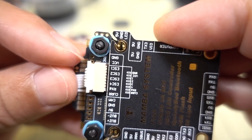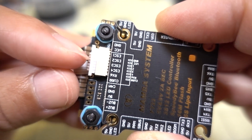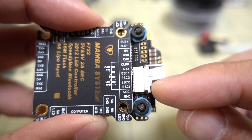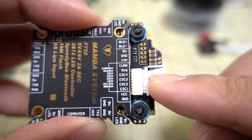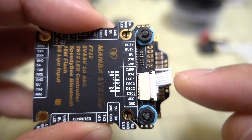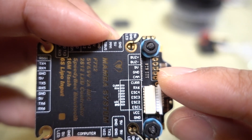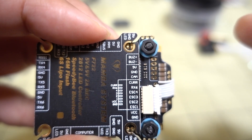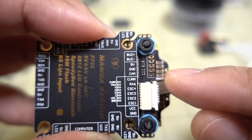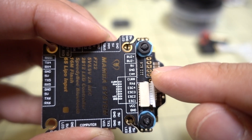On the top end of the board you have your ground and VCC pins, tucked behind the connector. The connections here include your current sensor, RX6 for ESC telemetry, and ESC motor signals 4, 3, 2, 1. You also have your buzzer connections and the camera input — and it looks like for the camera it's 9 volts only. For most cameras 9 volts should be fine, unless you're using a nano-type camera from a whoop that only takes 5 volts, but this stack is more targeted at 5-inch and up builds.